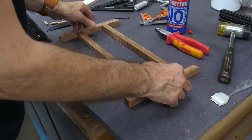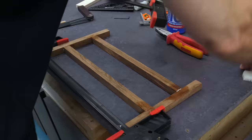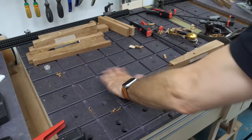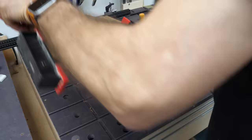The dowels have a pretty nice fit and after a quick wipe over to lose the worst of the glue squeeze I can get it all clamped up. Then slid across to the MFT where I can clamp it flat onto the tabletop. This helps make sure it doesn't twist as the glue dries.